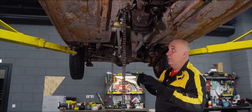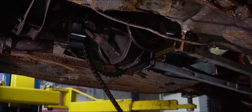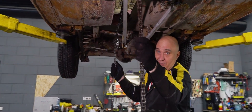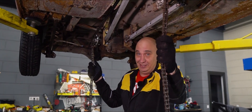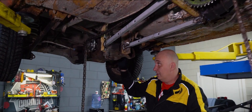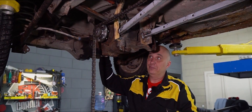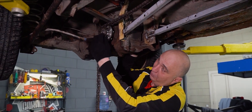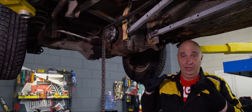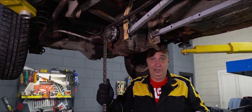This one is sitting there nice and tight. Between the flange and the sprocket we have a spacer. We've test-fitted the chain. Now, I gather you guys have already noticed that the system we're running is different from what you'd find on a motorcycle - but we'll get to that. Back here we've got another diff attached to the rear axle. It's also placed end-to-end, with a sprocket bolted to the flange via a spacer. Again, we've mounted these firmly - we just don't have the leeway. We can't have these diffs moving around if we want the chain to stay in place.